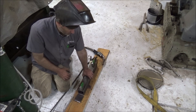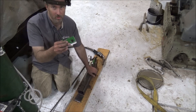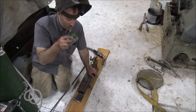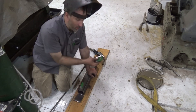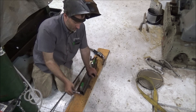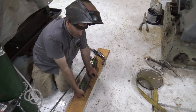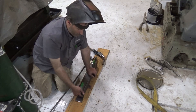I've got the square tube here that matches the clamp profile, and then I've got some half-inch plates with three-quarter-inch holes in them. This is what it takes for the shackle for the hoist. I put the hole on the winch end so that's where most of the weight is, and the other end hardly carries anything. I put it to the outboard, and I'll add a plate to the end of the tube on the heavy side that'll tie into the bracket on top and spread the stress out over the whole pipe — pulling across the whole face here and not just on the top middle of the box.